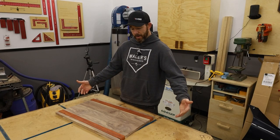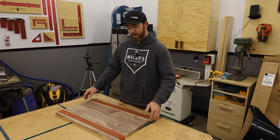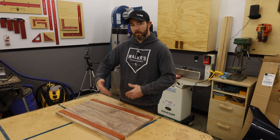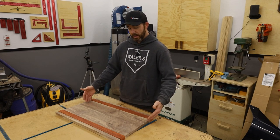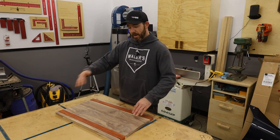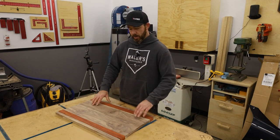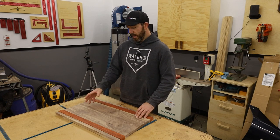So this will end up being basically a big cutting board. I did make it longer than it needs to be, but not wider. So once I clamp it and glue it up, it'll be the right width but a little bit longer so I can trim the ends and make it all square. That way I don't have to worry about keeping the boards exactly the same on both sides while I glue it up — it's just a little easier that way.